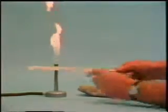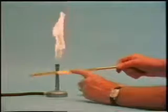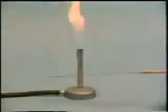So far we've been dealing with the problems caused by thermal expansion, but we can make use of the phenomenon. You've probably seen a demonstration like this — this is a bimetallic strip, brass on one side fixed to steel on the other. Brass expands more than steel for a given temperature rise. So if we heat up the bimetallic strip, it bends. On cooling, it straightens out again.